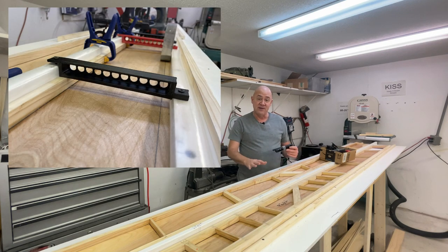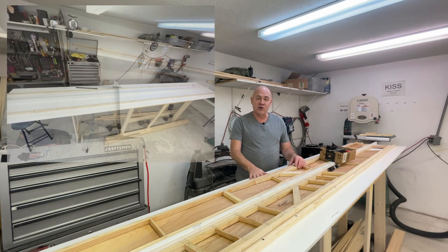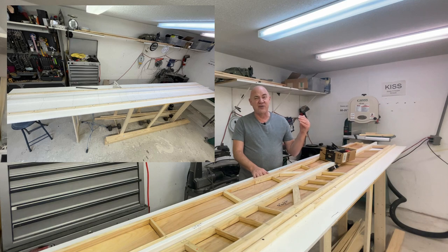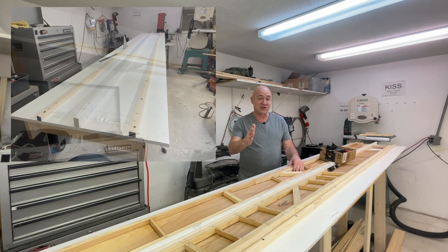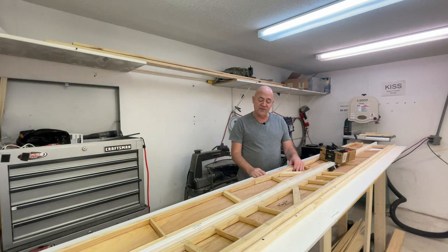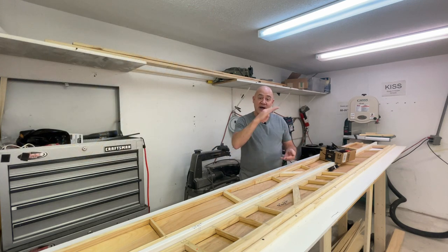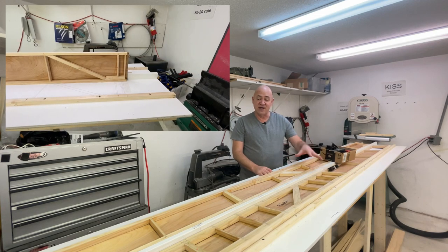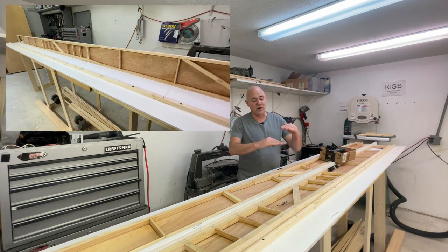Let's go through some basics on the table. It's made out of quarter-inch plywood. I used a three-quarter-inch by one-inch piece running down the middle and used my laser to get that straight. I then stripped on my table saw a couple of three-quarter by three-quarter inch pieces, got the laser set, and placed them at the width of each spar height — big spar on this side, small spar on the other, the front spar and rear spar, one taller than the other.